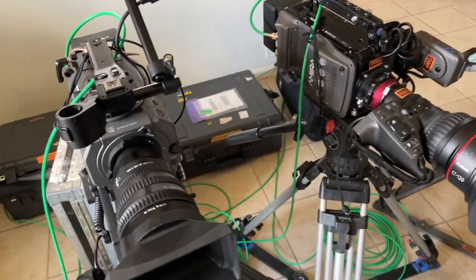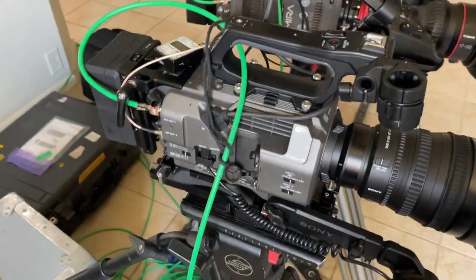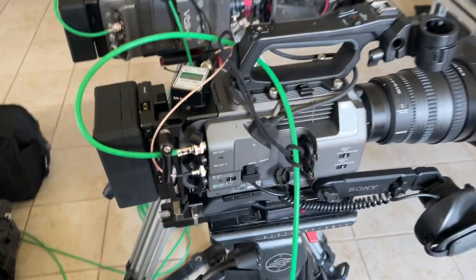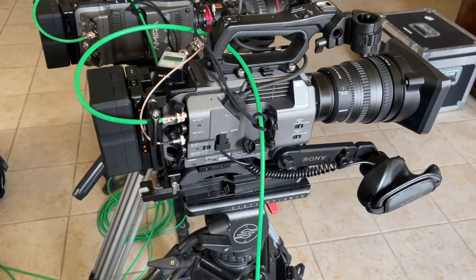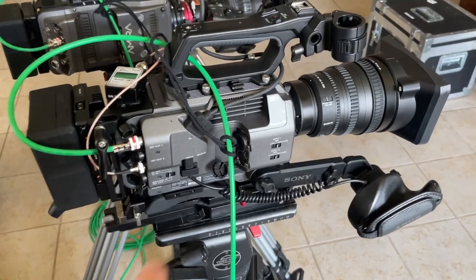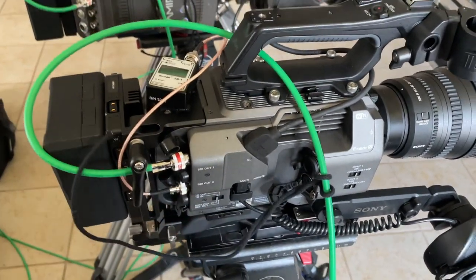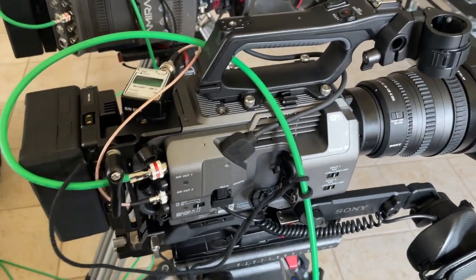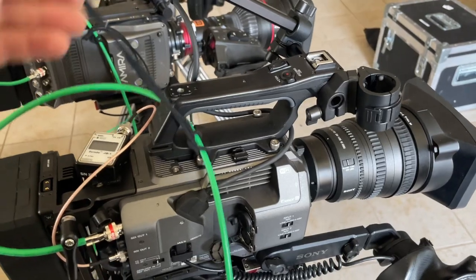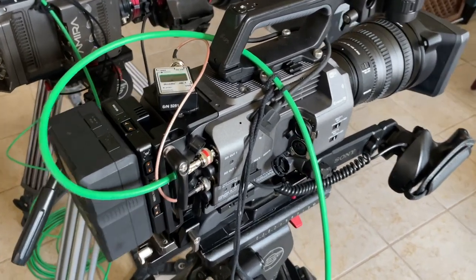The reason I'm making cables is I had some broken BNCs, and this frustrates me to no end. I work in all these different cities with local crew - might be my first time ever working with these people - and consistently I get people in new markets who have no respect for cable. They'll connect to a camera or monitor, just let the cable fall off the back side, and as you're moving around through the day it's yanking and stressing the connector. I had two BNCs get broken in my week in Miami from careless cable strain. I tell everyone: loop through the handle, tie off to the handle, and same thing on the other side - tie it off, save the connectors.